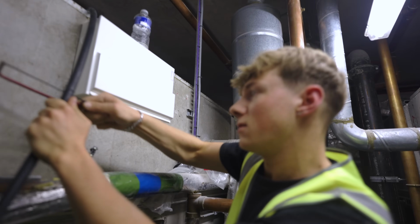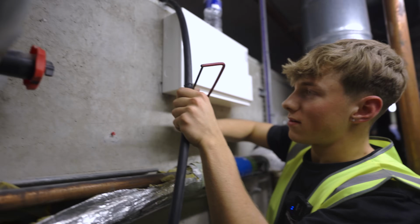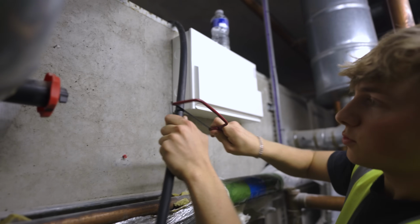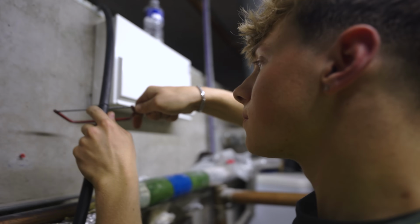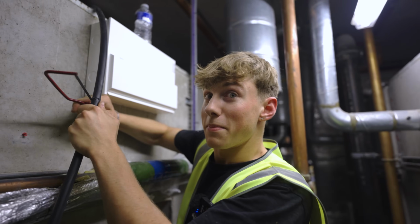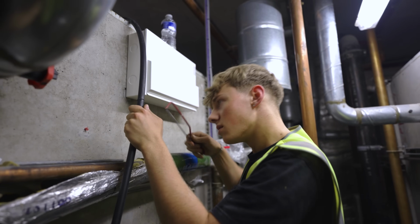Talk us through it. If you can teach someone how to do something, then you fully understand it. So tell me what you're doing. First, you're going to run a ring around the cable. You're going to want a nice straight ring, or you're going to cause yourself complications when it comes to putting the gland on. Because you need it all to be straight so it lines up with the cone thing with the triangle on it. You don't want hockey sticks, is what you're trying to say. Yeah, because when I first did this, as Mike knows, there was many a hockey stick, and that gland had to be retired because it was so damaged.